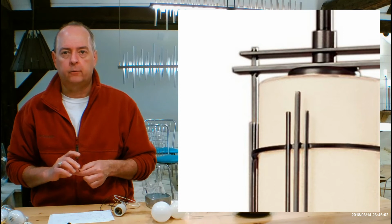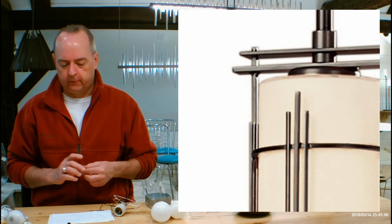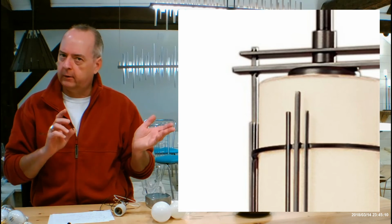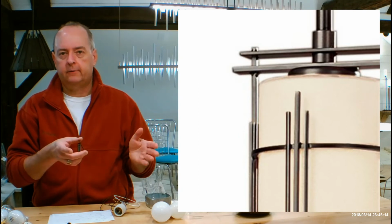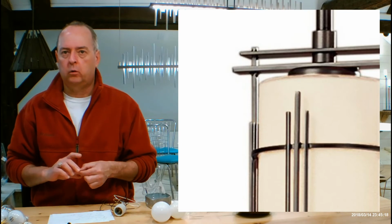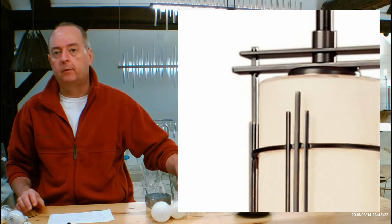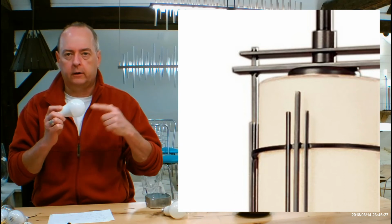So when you guys are in a hardware store, a small little hardware store in your town, where you should go first, make sure you look at the box, and if for some reason you have to go online, Amazon or one of those things, it's going to tell you right off the bat, 3000 Kelvin, warm white, 4000, 5000 Kelvin, cool white or daylight. The other thing is make sure you get a dimmable version of this, and put it on a dimmer that's going to be set up for LEDs if you guys want to go there.